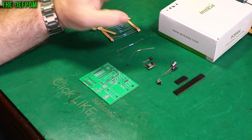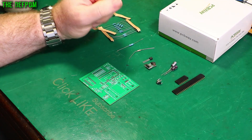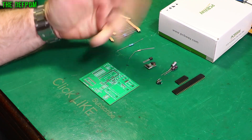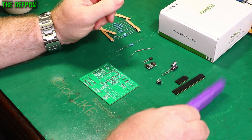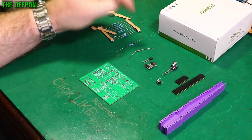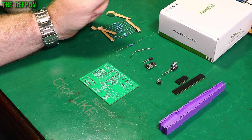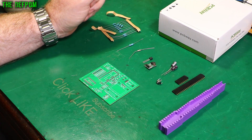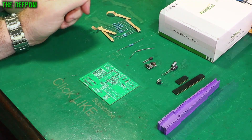I'm not going to put the parts directly onto the board — I'm going to use headers for the Arduino and the screen. It just makes it easier to work with in future, to make sure if you have to do repairs or if the board doesn't work for some reason. I also have my former over here for forming the leads on the components. Not like we really need to, but it's just nice to get a more uniform look by bending them in one of these formers. Again, thanks to PCBWay.